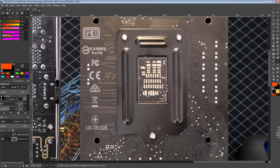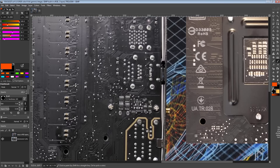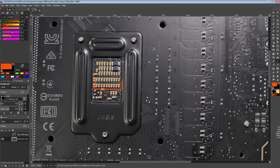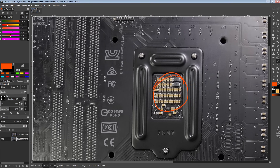The multi-layer ceramics around the socket — I suspect the two slightly different-colored ones are for memory power and are probably 10 microfarads, while all the other yellow-colored ones should be 47-microfarad 0805 capacitors. You literally can't get a higher capacitance 0805 multi-layer ceramic — 47 microfarads is the max. Asus has really jammed a ton of capacitance into the socket to improve transient response. For comparison, the Maximus 11 Gene has smaller, fewer capacitors and no tantalums anywhere. I have very high expectations when I finally hook up the oscilloscope to this board, because Asus has absolutely gone to town on that CPU socket.